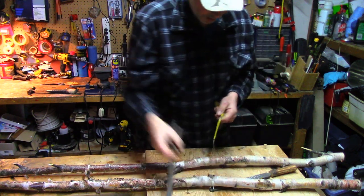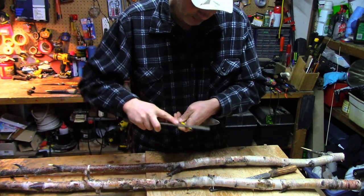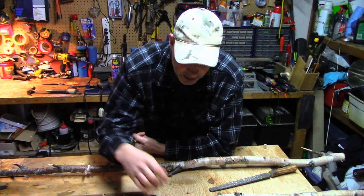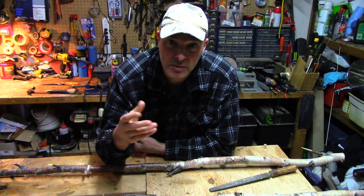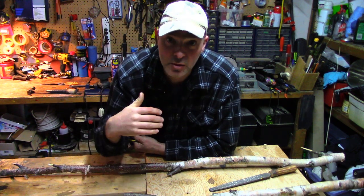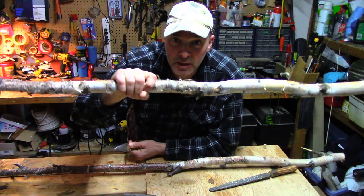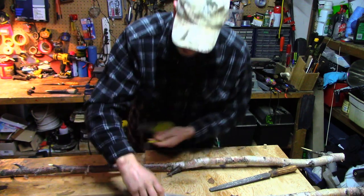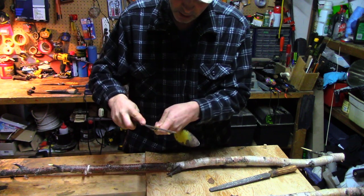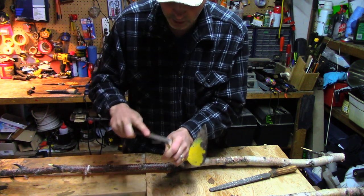One thing you want to do is get some of the metal bare. So what you're doing is pounding it into a piece of green wood — that is to say, wood that hasn't been dried out. I just went in the woods yesterday and cut these sticks to use for this today. It's green wood in so far as it's got water in it, so there's a moisture content in this wood.